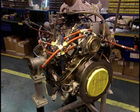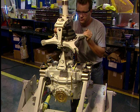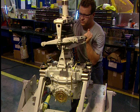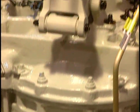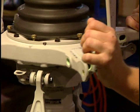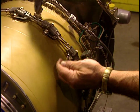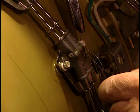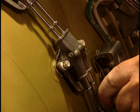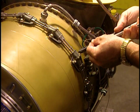The motor arrives. This one weighs 260 pounds and has to be carefully handled. Among the other parts to be installed is the circular plate on which the blades will be attached. Safety is primary. The screw nut holes are perforated, allowing for the insertion of the brake cable. This tightly braided metal wire prevents the nut from loosening due to strong vibrations.